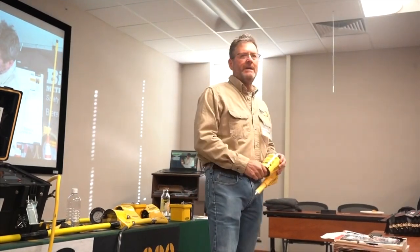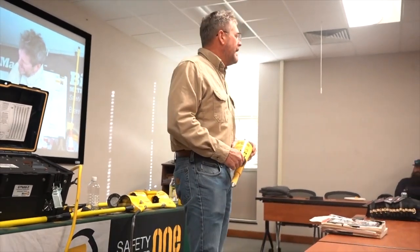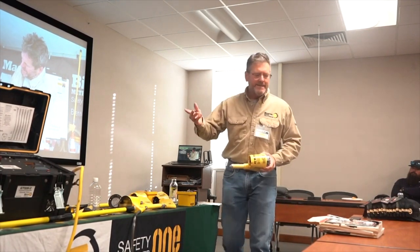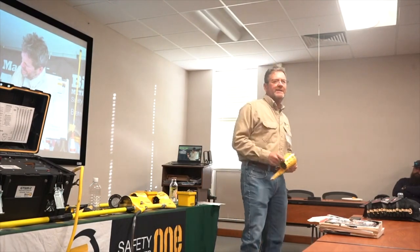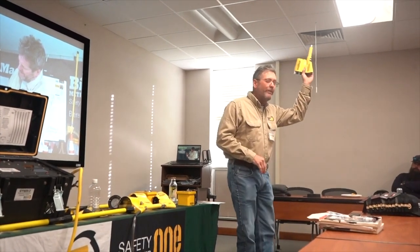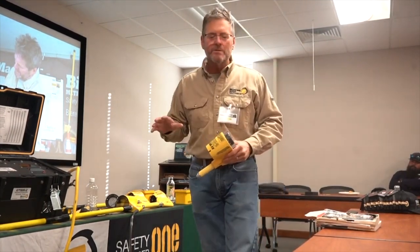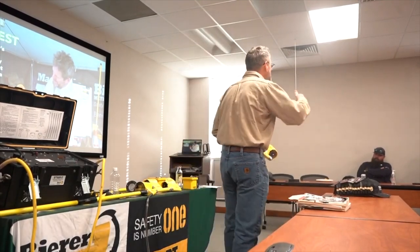I was at a large utility several years ago, in front of the work methods and safety people. They used a different tool, which is fine. But they told me they had trained their linemen for decades — hundreds of linemen — that the battery test is a true tool functionality test. So if you're using the tool on high voltage and you're testing a nine-volt battery, you're telling me the tool is good on high voltage? That's completely false. There is no transformer inside anybody's tools stepping up nine volts to high voltage for a true live known-voltage test. None. It's just a battery test.